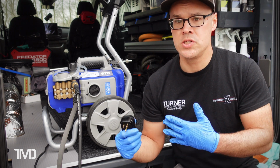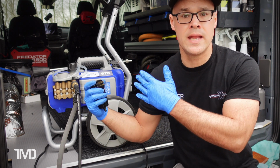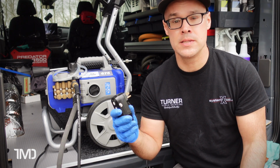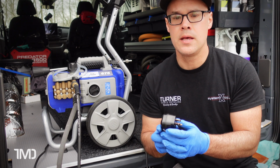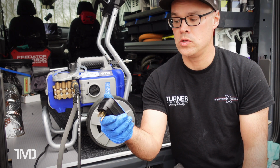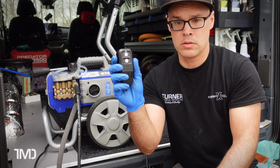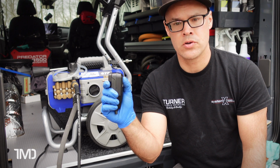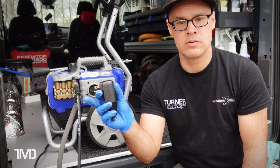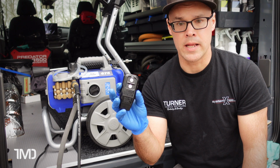But the reason why my machine wouldn't turn on: it wasn't even buzzing, so that tells me that power wasn't even getting to the unit. So that told me that the problem had to be somewhere before the unit in line. So I checked my GFCI, and normally when you reset it or turn it on, the little LED light indicator will turn green, and that was not even turning green. At first it was very dim, and then it totally went dead altogether. So stressing this out totally fried it, totally killed it.